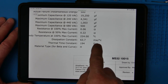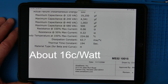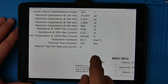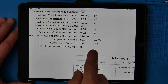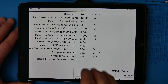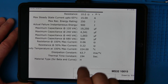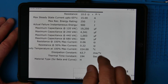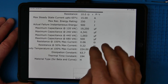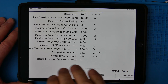Here's the dissipation — another interesting parameter: 63.7 milliwatts per degree C. If you flip that equation, you can multiply by how many watts of energy you're putting in and that'll tell you how hot it's getting. The thermal time constant is 194 seconds. So if you did take a 19,000 microfarad cap on 120 volts and applied power to charge that cap up, it would handle it. But afterwards it would take 194 seconds to cool down before it's ready to do it again.